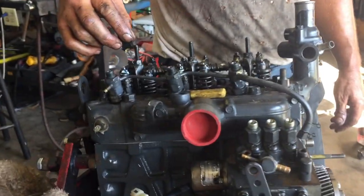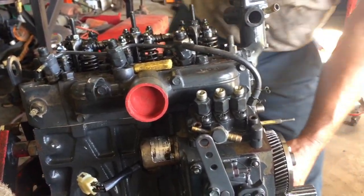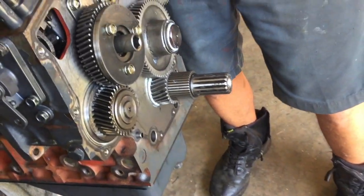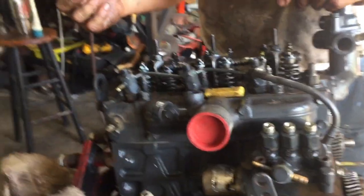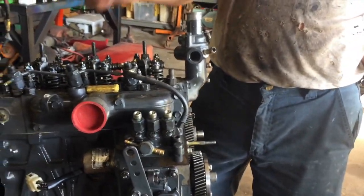putting the valve cover on and the timing cover for the most part. And you know, there's a couple of O-rings that go on the front timing cover. You just have to pay attention, one here and one there, and make sure those are there, and we're wrapped up. You know, the rear main seal I've got to put in yet. Injector lines, that stuff's always pretty straightforward. So that's basically our build.